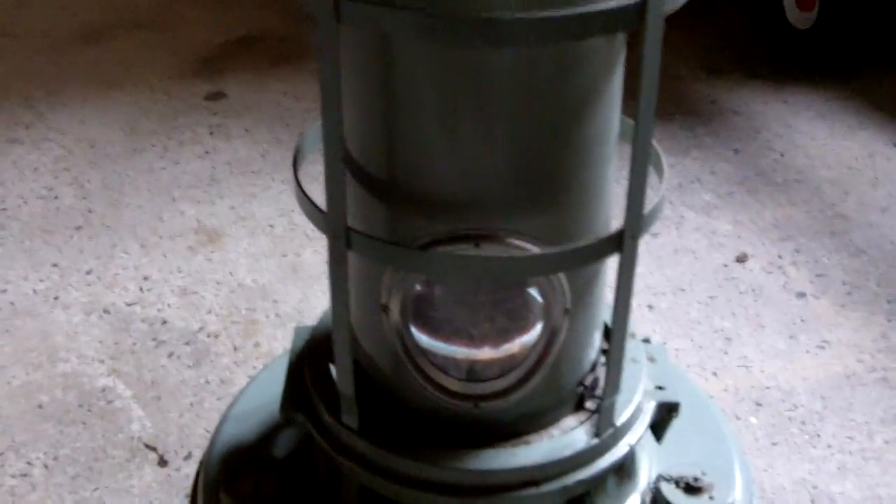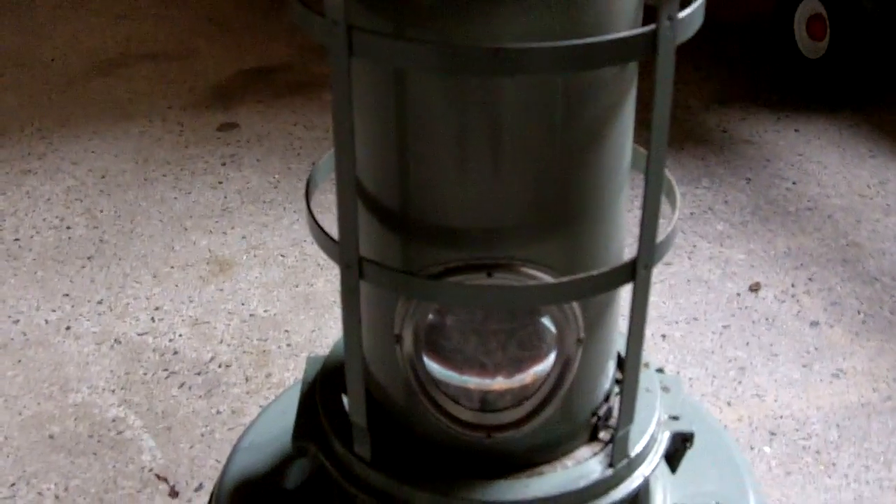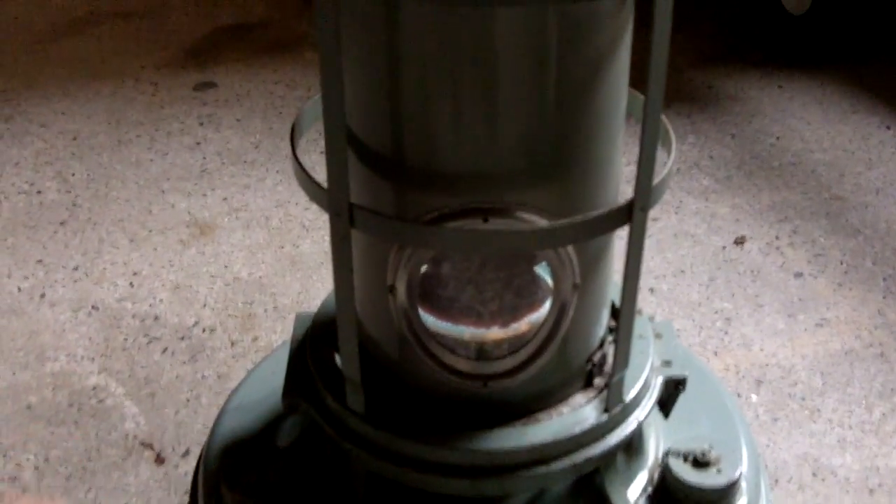You have a flame here, so you have to make sure you have proper ventilation. This is a garage and there's plenty of ventilation even when closed. Always use this with a carbon monoxide detector in the rooms where you would be using it. I do have one here. In any room where you see yourself using a kerosene heater during a blackout, you need a carbon monoxide detector just in case. If it's a large enough room, a little bit drafty or open to a hallway, you wouldn't need to crack open a window, but it's better to just play safe. Definitely don't lock yourself in a room trying to stay warm with a kerosene heater because it's deadly. The carbon monoxide detector is mandatory along with a kerosene heater.